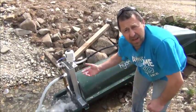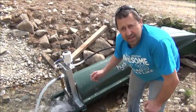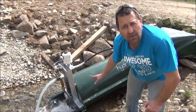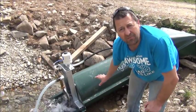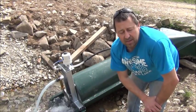We've come up and done a few improvements to this hydraulic ram site up here in Renferley. We've now got all the water going through it, which is good. We've got a little bit more fall and we've got a foot valve on the end of the suction hose, and it's pumping well.